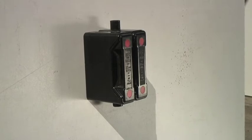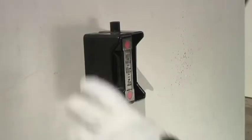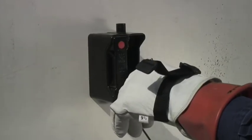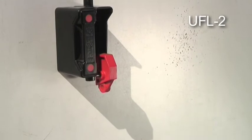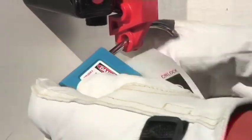Now to show a UFL2 on a fuse holder. Remove the fuse link. Place the UFL2 on the edge of the fuse holder. Tighten screw with a small screwdriver. Place padlock with a danger tag through the hole, preventing access to the screw.